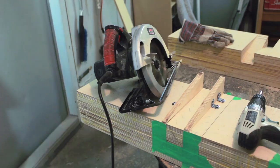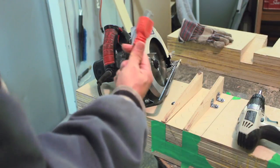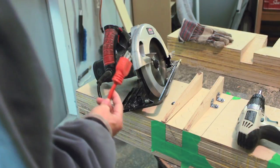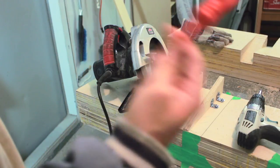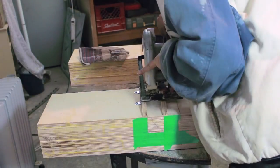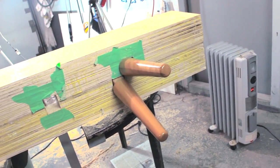See, this one is so quick and easy — it's nice and smooth, practically no chiseling necessary. Now, a word of caution: when you're adjusting the height of the blade, always unplug your cord before handling the adjustment, just for safety. Sometimes you might unplug the wrong cord and not the one to the circular saw. So if you want to keep all your fingers, make sure the cord is unplugged before you readjust the blade.